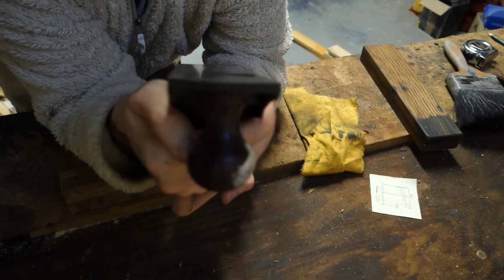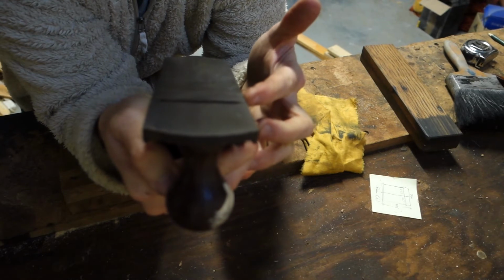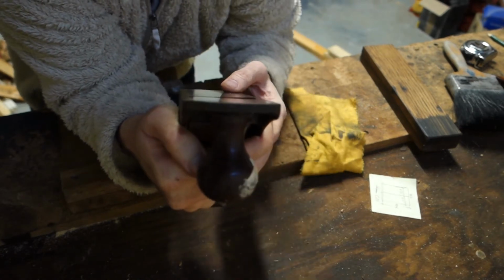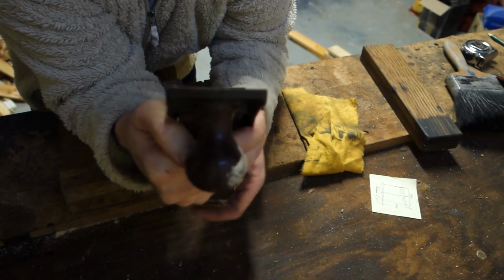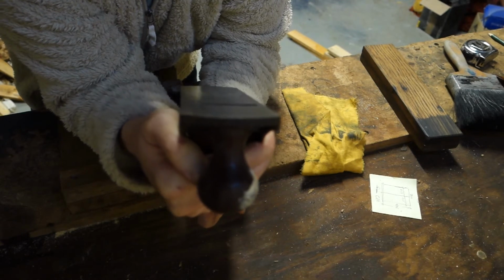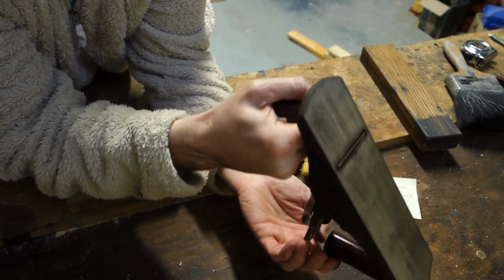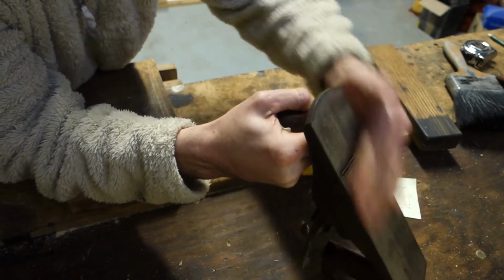You can see, I think you can see it now. Let's have a look. Yeah, I might be able to cut this out. Right, you might be able to just see the blade there now. So if I just get that, you can see the blade move. So what I'm looking for is the blade to be square along the length of the bed, which you move about.